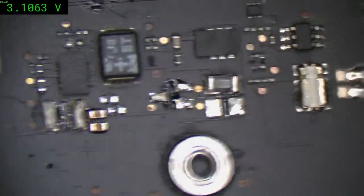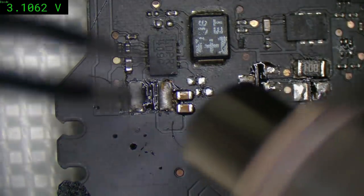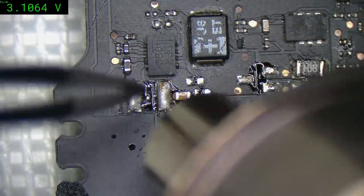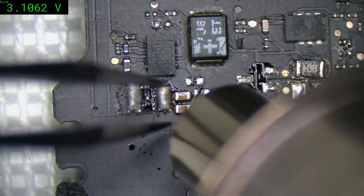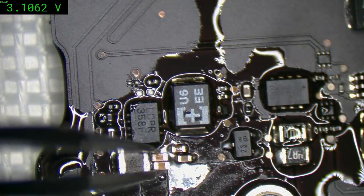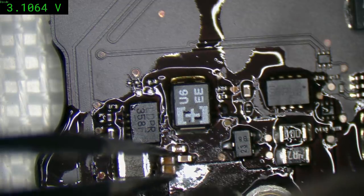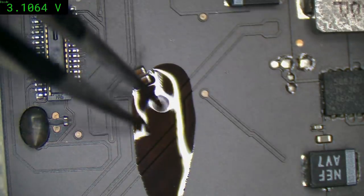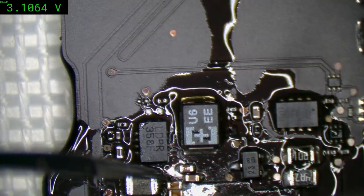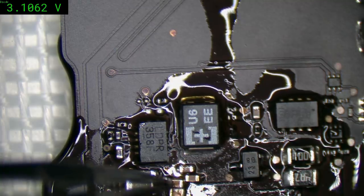Yes. Because the caps are in parallel. They're just working together. Often what it is, you do a bit of a decade difference, like you'll have 0.1 microfarad, and then have 1 microfarad, and then... Yeah, just a magnitude difference between each. And it's just so that you can respond to the different... Drag it through a bit of flux. It's so that electrically you can respond to different frequencies of spikes, current demand spikes.